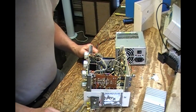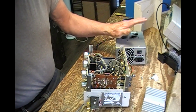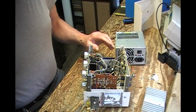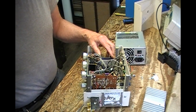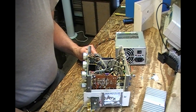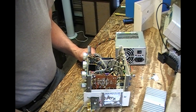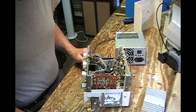And I looked to say, well, the heck with this, rather than replace, or at least adding a plus minus power supply for this, I'll find some Chinese pre-made boards that don't have that problem, and as far as I could look, they all seem to have that 10 ohm isolated ground situation, and so I might as well stay with the one I've got.